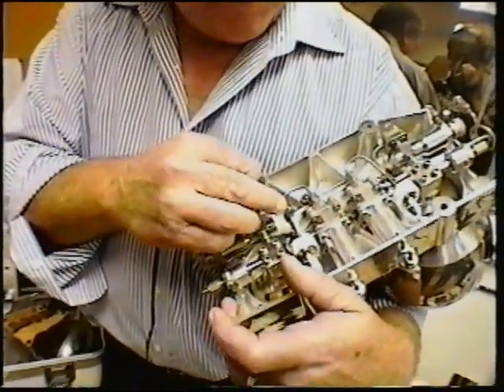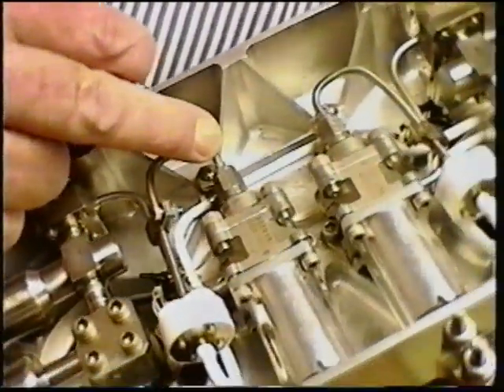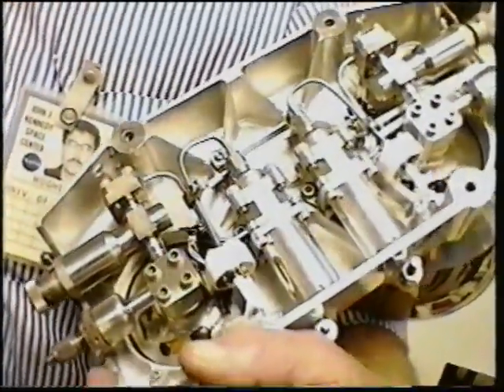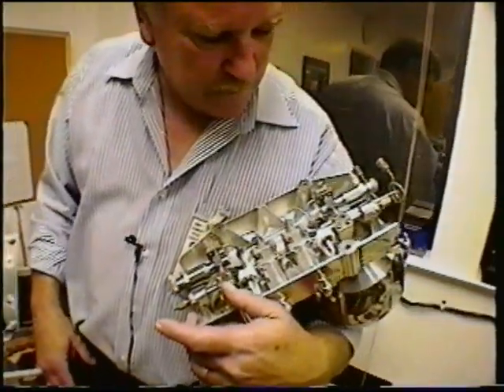Since there wasn't any temperature fall in the nitrogen bottle, we're pretty sure that what happened was that it jammed up with debris from here. If this gets blocked anyplace, it's 6,000 PSI on this side and around 100 PSI on the other side. If it does jam, this side will slowly go to 6,000 PSI, to which it's never been exposed. When that happens you can get a leak, and that leak would be what the spacecraft began to react to — its sensors would have told them they were beginning to rotate. Was there an attitude correction? Yeah, that's what they got upset about, because it kept correcting for attitude for something that went on for like 24 hours, and so they assumed that it was us.